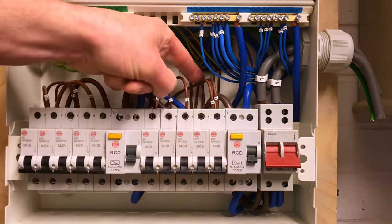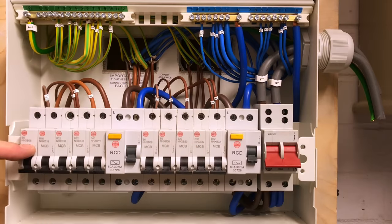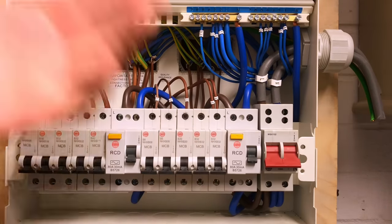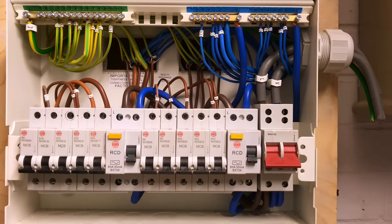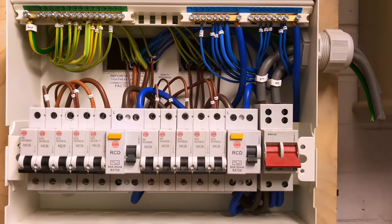Let's look at the rated values in amperes of the overcurrent protection devices and relate them to the type of circuits being mimicked. This is a 32 amp Type B breaker — all the breakers in this distribution board are Type B. The type is matched against the inrush style of currents given by the loads. As homes become more modernised we might occasionally have inrush issues with things like air conditioning units or certain types of LED lamps. Generally in a typical domestic dwelling a Type B will be fine, but it must always be matched against the type of load to be installed.